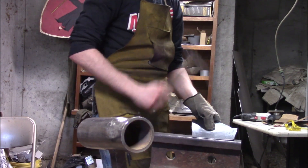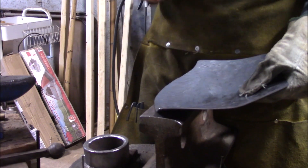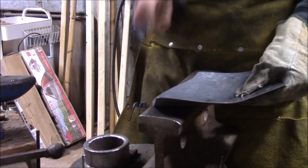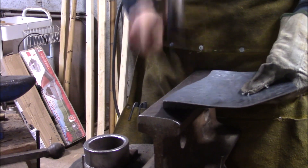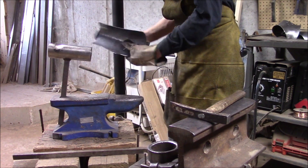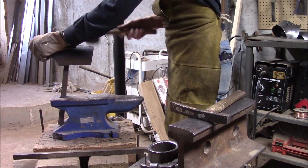You're not out of the woods yet though. After you've applied a little bit of curve with that cross-peen hammer, grab a ball-peen hammer and apply a little bit more curve and volume. Sometimes a little bit of muscling it into shape with a mallet over mandrel is required, where you can't quite get with those other hammers.